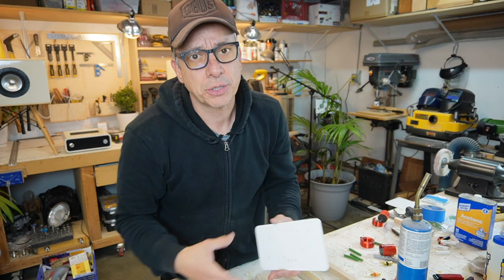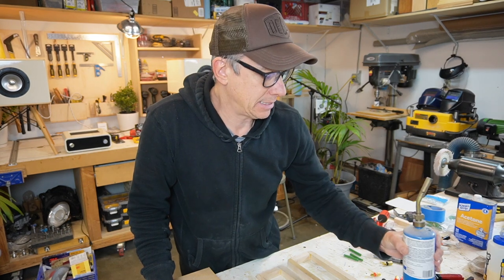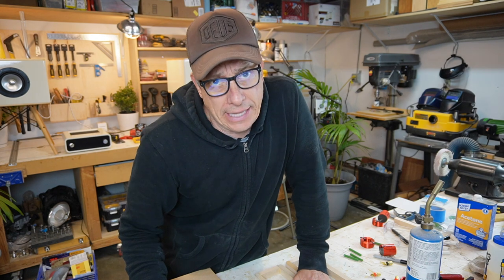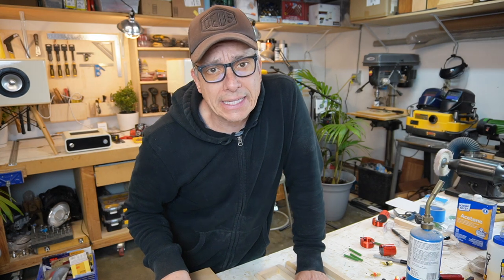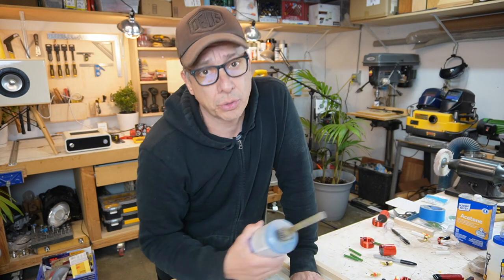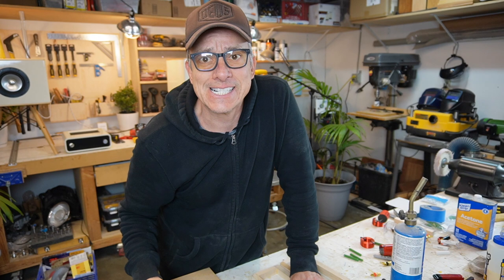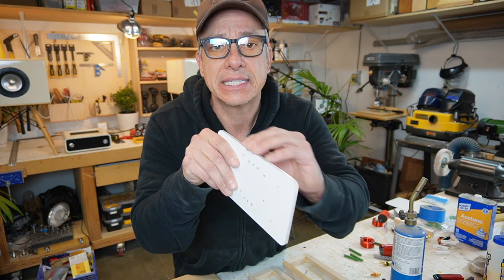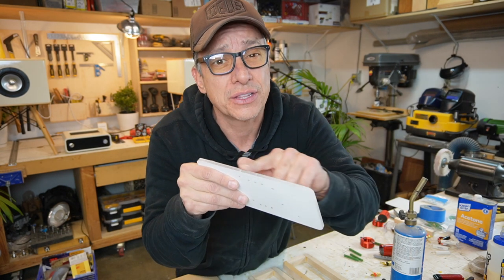There are different ways to polish the acrylic, right? We can burn the edges, and it's pretty efficient. The thing is, you always have to sand it. Sand it a lot. You sand with 220, then you sand it with 400, then you sand it with 800, then you start buffing, or you can blowtorch it. And it gets polished and beautiful and looking good. So that makes it pretty nice, and you won't cut your fingers. Usually you cut your fingers if you slide it through the acrylic.